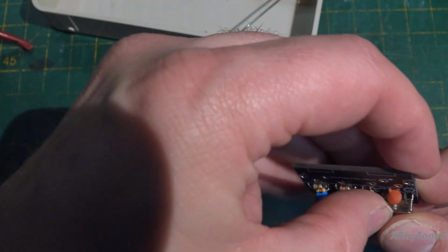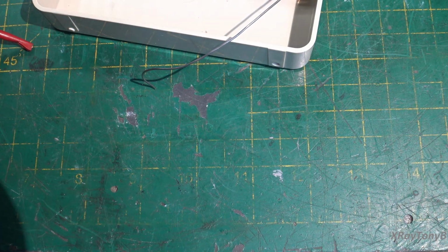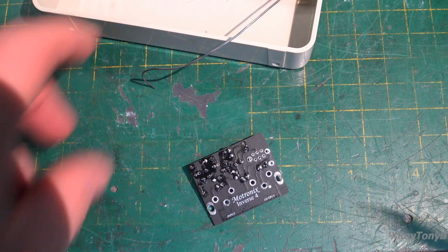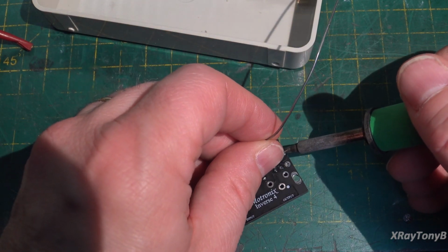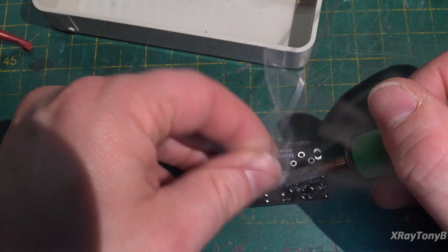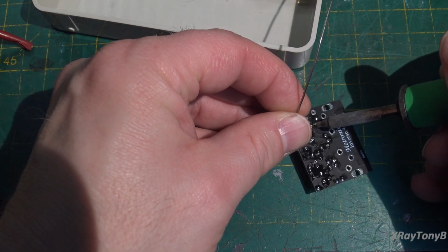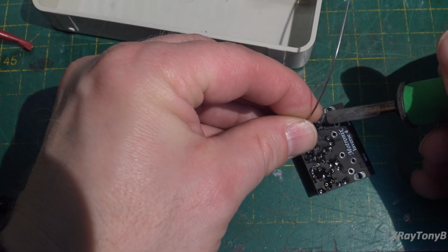And who knows, maybe one day we'll get crazy and we'll design our own RIAA circuit that's a little more accurate, but that would just be a novelty item because I really don't need it. The only time I use these kinds of things is just to test and make sure it's working in general. If you want to evaluate an RIAA circuit in a phono stage on a system, you would need a very accurate one of these, and you would need very accurate signals to feed into it so that when you measure the output, you can tell if the de-emphasis circuit is working properly at all the different frequencies.